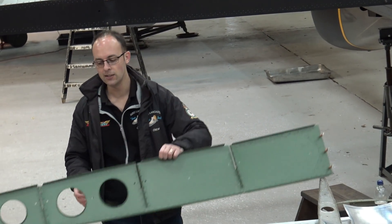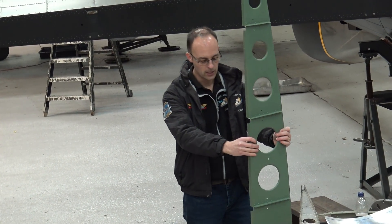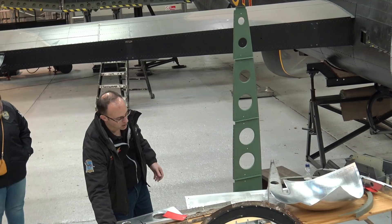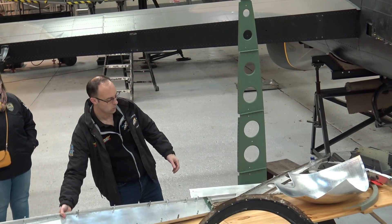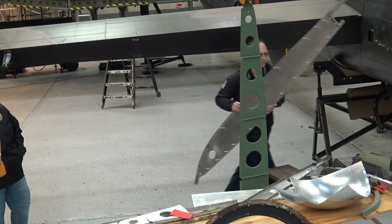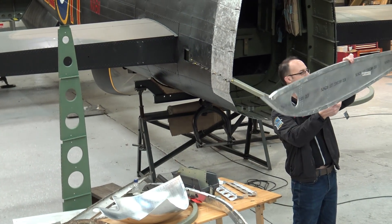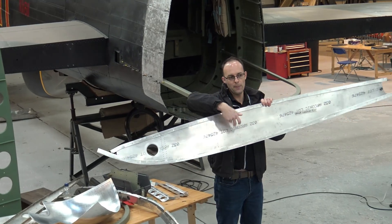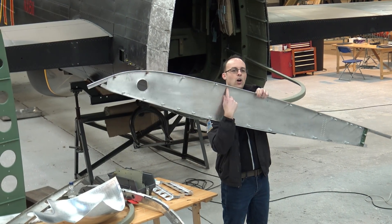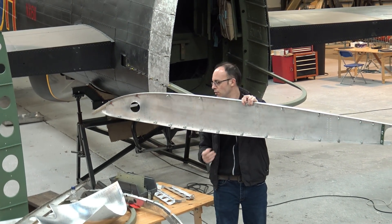The wingtips are held in the jig vertically. The bottom of the jig is the face that attaches to the wing and the top of the jig is the wingtip. This here is part way through production — it's a set of two extrusions: an extrusion at the top, an extrusion at the bottom, and a web of sheet metal in between. It bolts onto the wing through a series of holes and studs on the edge of the wing. These still need the holes put through the extrusion.